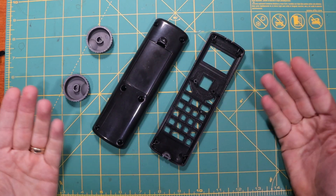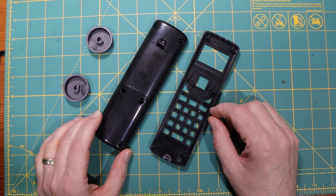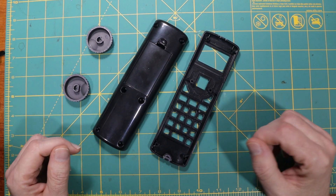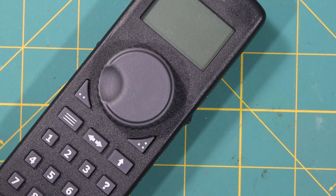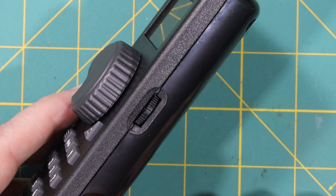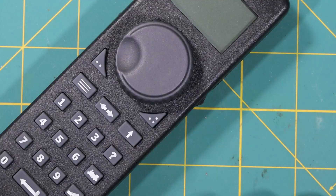Now, that's the other interesting thing — now that we said we're ready to go into production, they put us at the end of the queue again. So it's going to be about a month and a half before we get final parts. After assembly, we noticed one final issue, which is flashing along here. What they're going to do is try to use a larger machine with more clamping force to see if that fixes it. So this has been a much longer process than we expected. If we're going to use the same injection molder in the future, we definitely need to have a heart-to-heart conversation with them about how long it takes to do revisions, because waiting a month and a half to two months between revisions has just killed the timeline for this project.